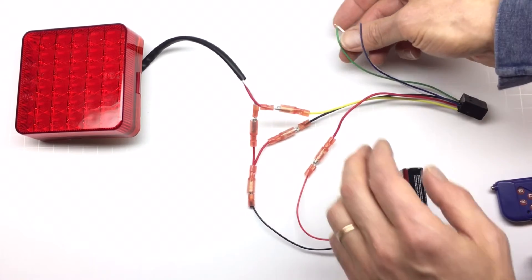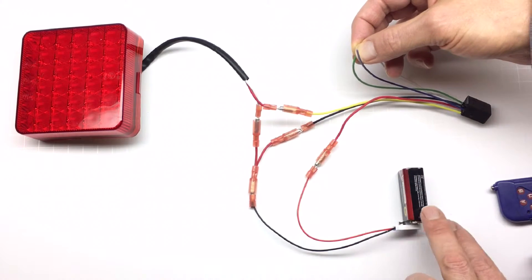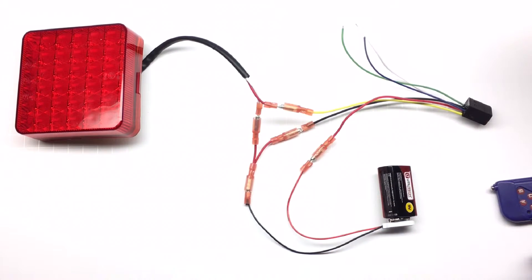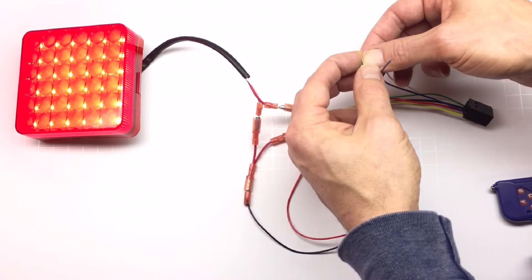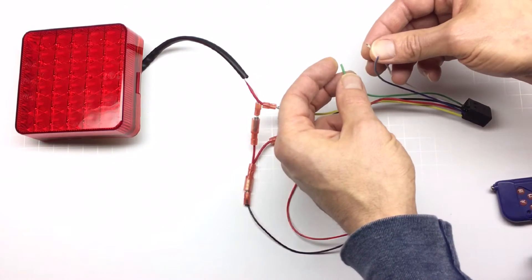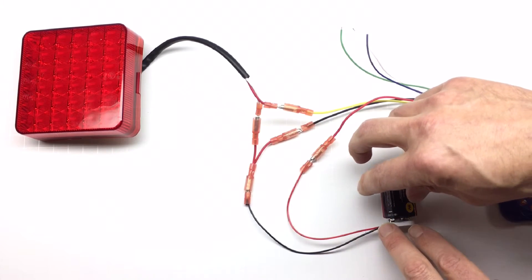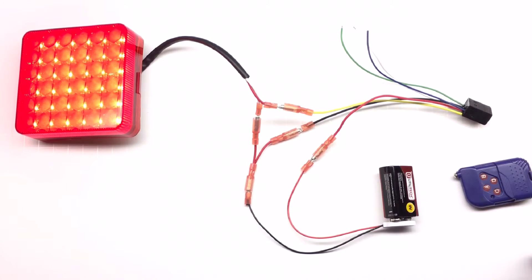To do that, I'm going to short two configuration wires — this is all in the manual, but I'm going to show you how it's done here. I'm going to power the module and disconnect the two wires. I'm not going to wait until the light comes on after five seconds, because that pairs the remote and we've already done so. Now I'm going to hold the two wires together for the desired duration — let's say five seconds — then disconnect and confirm it by shorting the two wires once. Now I'll supply the power and by pushing the remote, I'm going to activate that non-latching signal, and it stays on for five seconds.